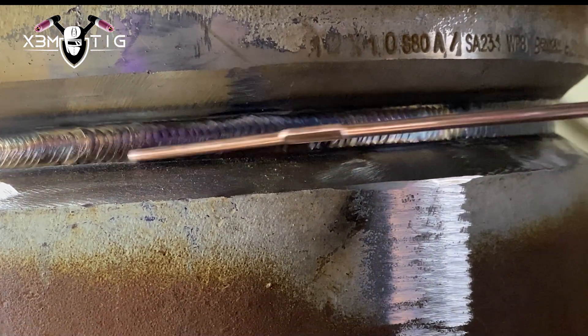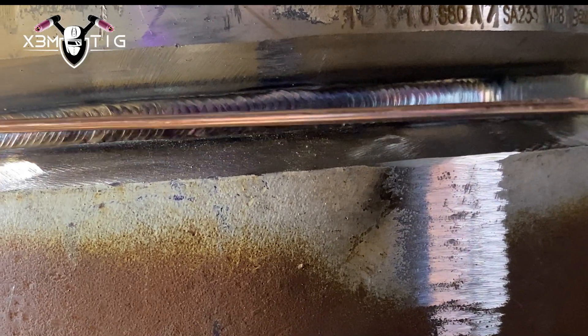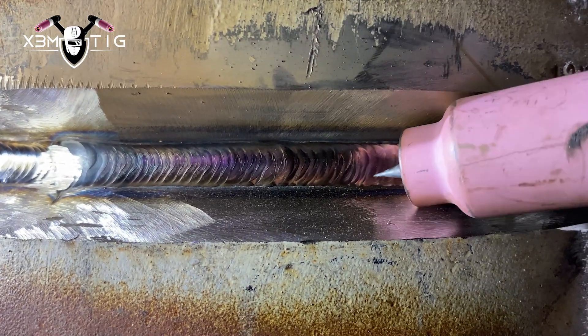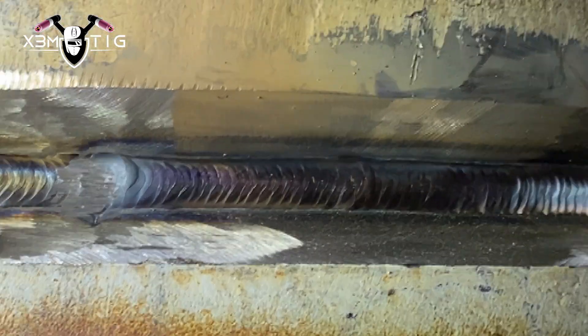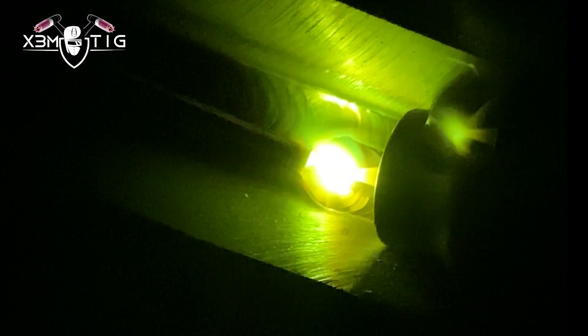For the fill, I'm going to do two fill passes for this welding procedure — one on the bottom, one on the top. It doesn't really matter what order; you can go top first then bottom. You can wiggle, walk the cup, or freehand — whatever is easier. You can change the size of your cup: bigger bevel, wider bevel, heavy wall — cup size 10 or 12, depends on how much. Just keep your tungsten always sharp, good amperage, good travel speed — you should have a nice clean weld. Now you're prepping for the next welding procedure, which in this case is stick.